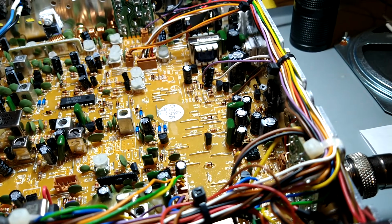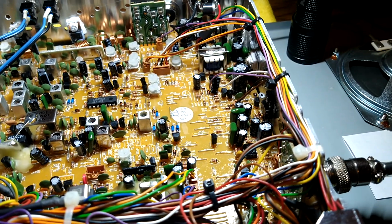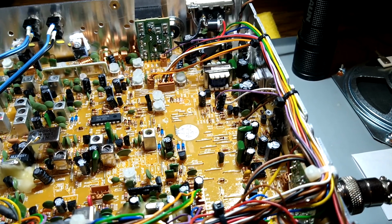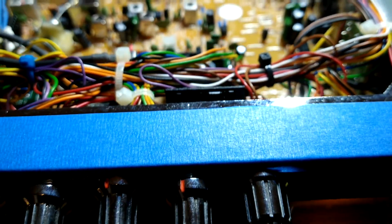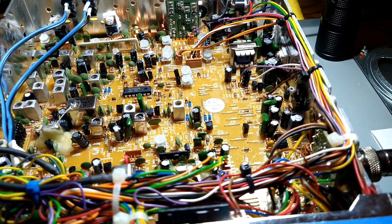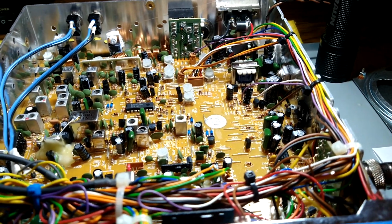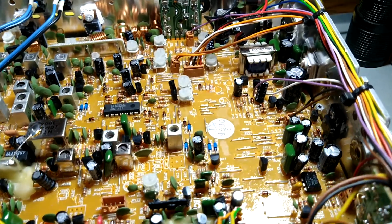It ruins a radio. It just makes everything so hot, and it makes it overwork all the time, and half your power is going to go on frequency, and half's going to go on 54 megahertz, and you're going to just splatter on probably 3, 4, 5 adjoining channels. It's just, don't do it.